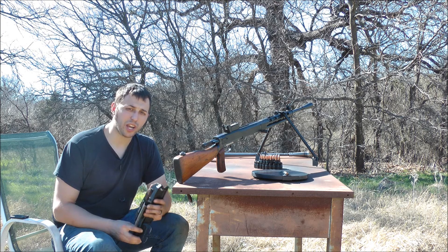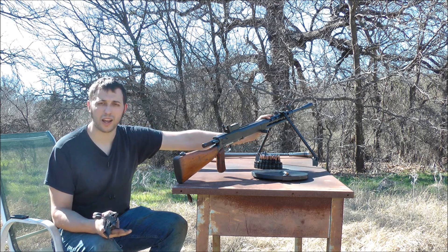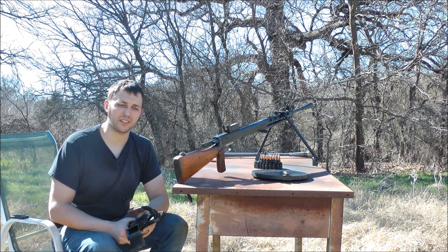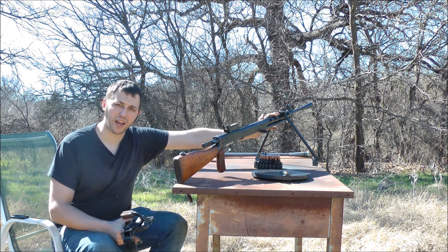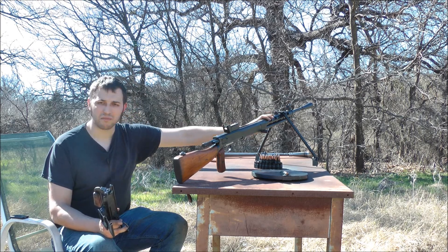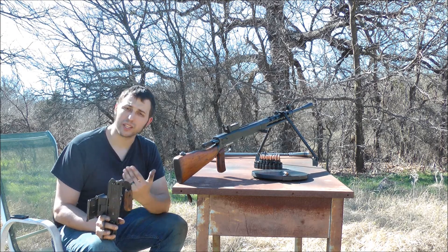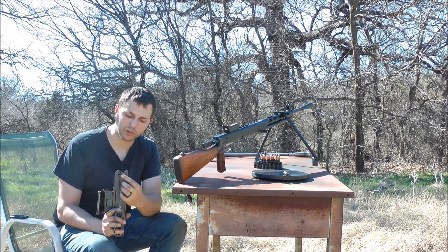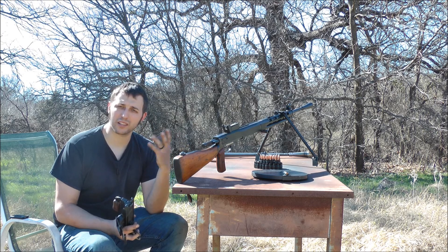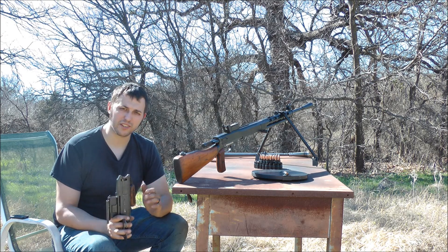Some of the things we are going to change: the way this hooks into that slot on the barrel shroud gets a little thin towards one of these vent ports. We don't really care for that, and we don't want you guys to have to send in your whole gun to have two parts modified to accept this top cover if we build it like the original. What we plan on doing is omitting the need for this slot by changing how this latch works. With it in an unlocked position, you snap it in place and push this over, and this little quarter-moon shaped lock takes a bite of the barrel jacket to allow you to carry the weight of the weapon on this handle. We don't really care for that, so we're going to change that up a little bit.